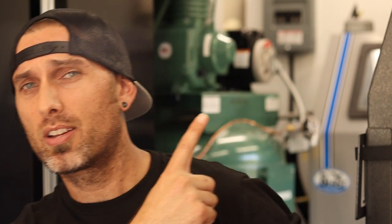The dry blast cabinet also has a little vacuum on the side of it between the cabinet you see back there and the compressor next to it. Down in that little crack over there, there's a little vacuum that keeps visibility up inside the dry blast cabinet when you're making a bunch of dust. So that's actually something else I was able to pre-plan and kind of squeeze into that dead spot back there.